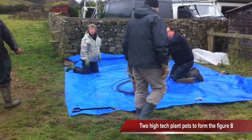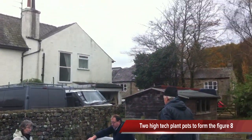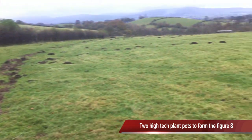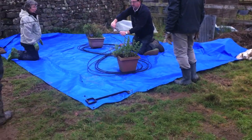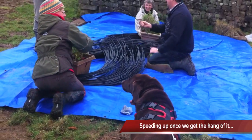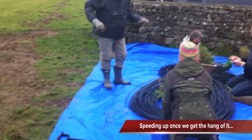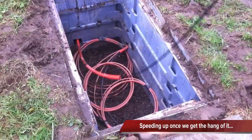So this is fleeting — we're blowing a thousand metres through this access chamber from one at the top of the hill over there, and this thousand metres will then be blown right the way down there to the village. If this works, this will save cutting the fibre and joining it all together, because there's 96 fibres in this one. This is the fibre being blown through the duct, and the little coils you see are the coils that go to these properties here.